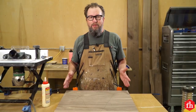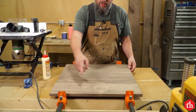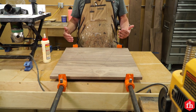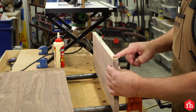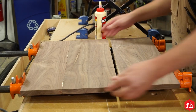Two pieces of this cabinet require wider panels, and since we're using solid lumber that means we have to glue up narrower boards to make those panels. I've got my pieces cut to length and both sides are squared up, and I draw this big triangle on here once I'm satisfied with the layout of the boards so that I don't have to think about which way they go when I glue them up. Start by edge gluing boards together to make the top and shelf, leaving them slightly longer than final dimension for now. When the glue is dry, cut them to final dimension and sand them flat.